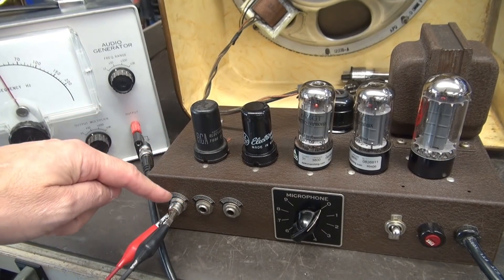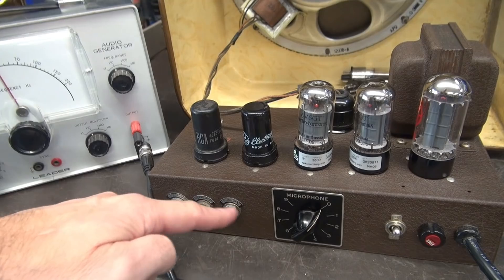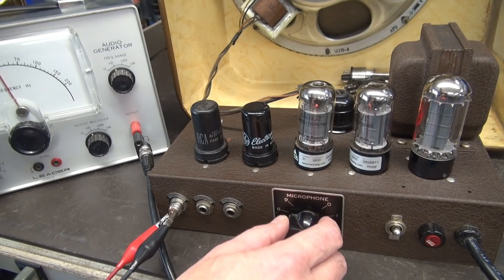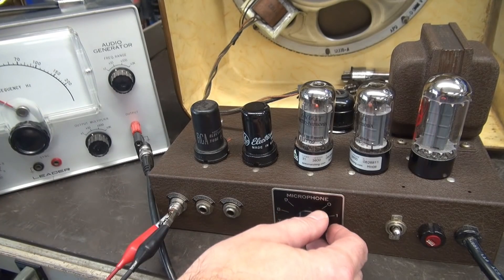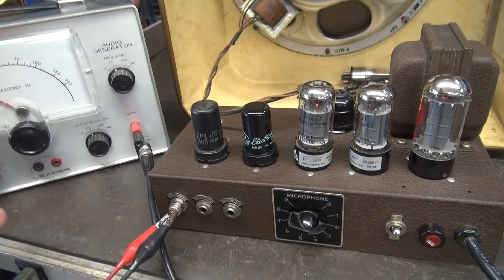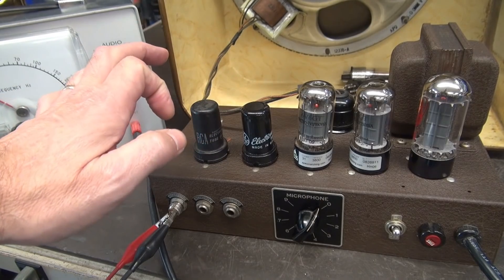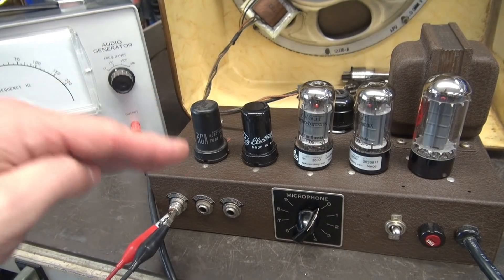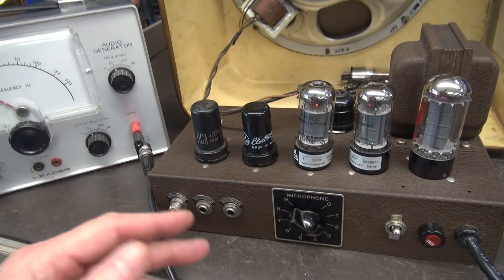Now let's pop a signal into it. How this is wired, you have to use the microphone jack first. Once that is being used, it opens up the shorting bar on that input jack and allows the other two to be used. If you try one of those first, you're probably not going to get much sound. All kinds of volume. You'll notice there is a little bit of noise when you turn this pot, and that's normal because that pot is going direct to the input of the inverter tube. There is a little grid stopper type resistor in there to help with that, but that's just a natural thing when you put a volume pot in line at that point. You're not going to be cranking on the pot all day — you're going to set it and play. It'll be noise free.